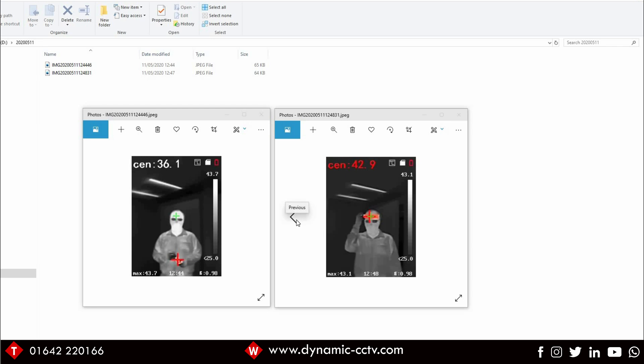The second image on the right is an alarm condition snapshot. The warm water bottle is now on my colleague's forehead, the hot spot has moved there with it, and the center spot — which the unit uses to measure the readable temperature — is showing 42.9 degrees in red, above the 37.5 threshold, so the unit is in alarm mode. There are two ways to use the unit: use the center spot as your temperature measurement, or use the hot spot as both measurement and alarm trigger. Various other visual settings are shown on screen including temperature in degrees Celsius, SD card and battery status, temperature scale with min/max, time, and emissivity setting.